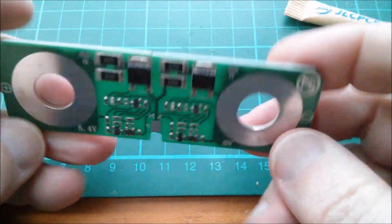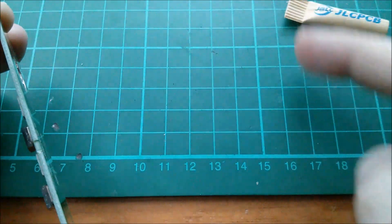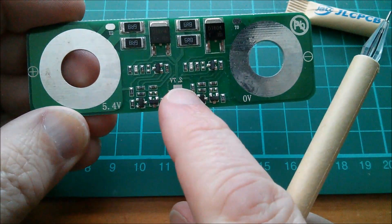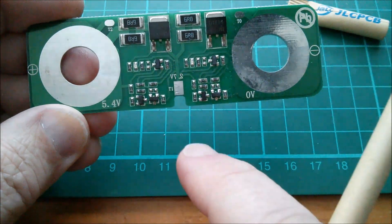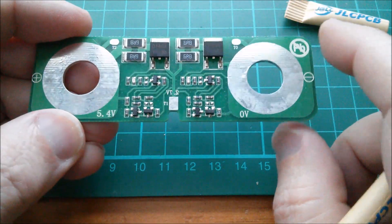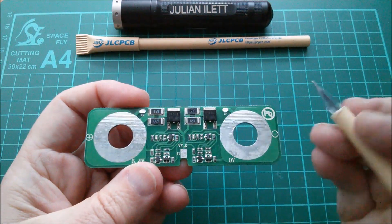I think you put these cylindrical ones, one here and the other one there, link them together at the other end, and then run a wire from this midpoint — which is called the 2.7 volt point, although they've put the silk screen on back to front — run that to the other end of the supercapacitors. So here you've got 0 volts and 5.4 volts.